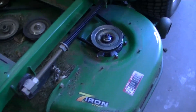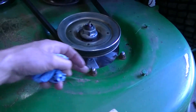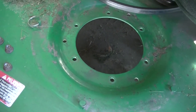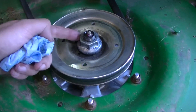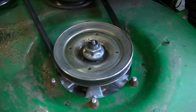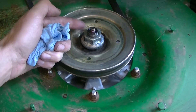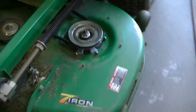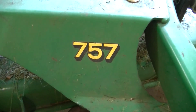That's all there is to changing one of these spindles. The new one is in there, bolted all the way around, got my blade back installed, and cranked it down with an impact. The old one was super tight, but I think the rotation actually tightens it, so I just hammered it on with the impact — should be okay. Greased it really good, so she's full of grease now and ready to go. Another repair done to the 757 — see you guys in the next one.